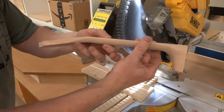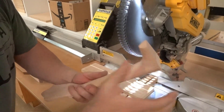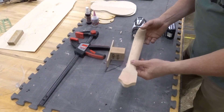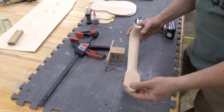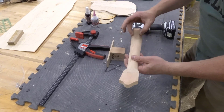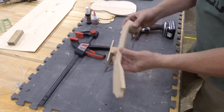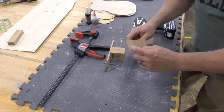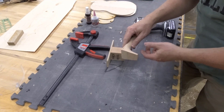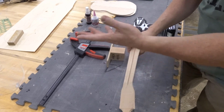Now the neck is cut to length. It is sanded and you have nice sharp edges in the back where it'll glue to the bottom. As I've been sanding and shaping it, I've been comparing it to the necks mounted on the wall to keep track of which stage I'm on. I've reached stage six because it's nice and flush. But please check with me before you move on to putting the fretboard on. For now, we're going to drill two dowel holes here and here for when this attaches to the body of the ukulele — we have to do that before the fretboard goes on top.